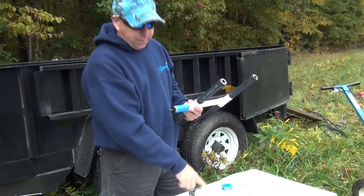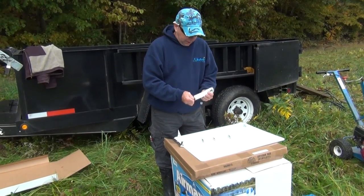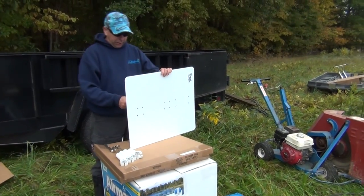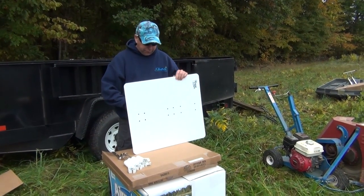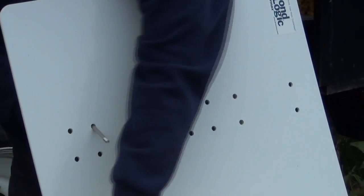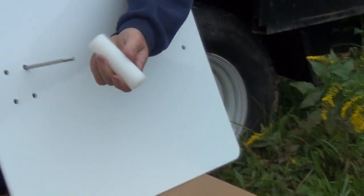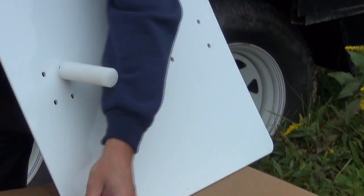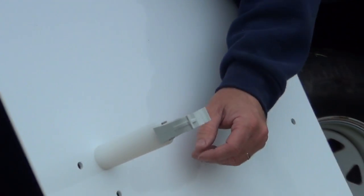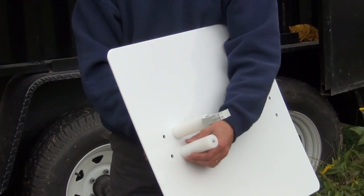We'll take a quick break to show you how to put these together. Here are the lift kits — get them all disassembled first, then decide which holes to use. I'm going with a pattern of four on this end and only two on the other end. The washer goes on the back, bolt goes through the washer and through the plate, then into the riser. Screw it snug with your finger since we'll need to adjust when we put the diffuser setup on.